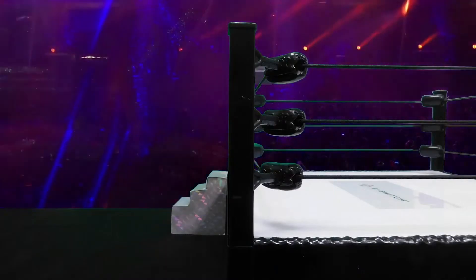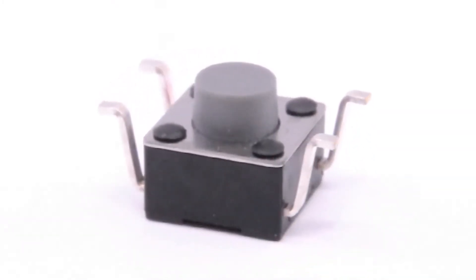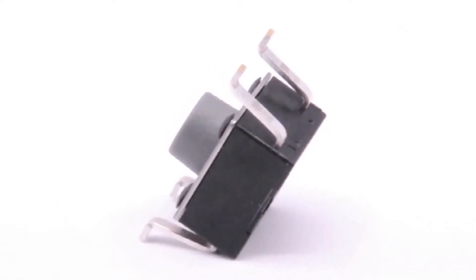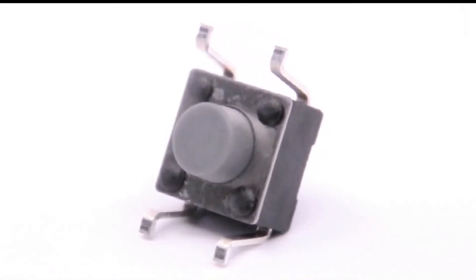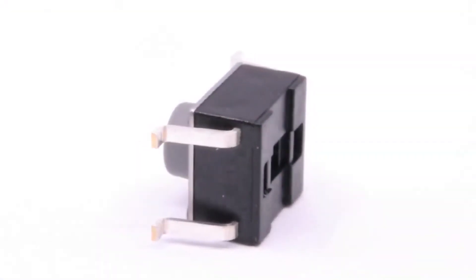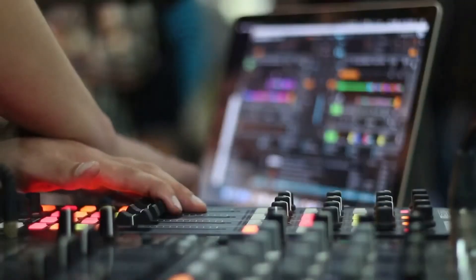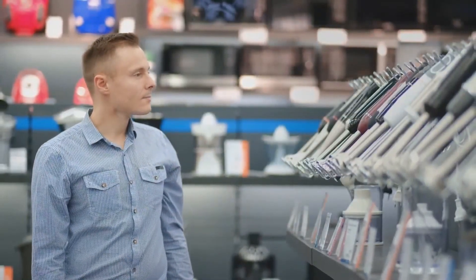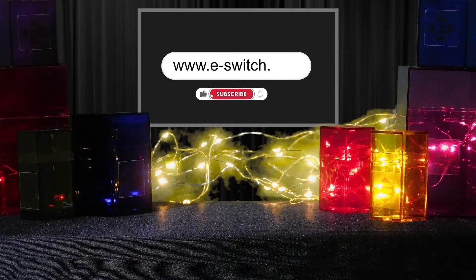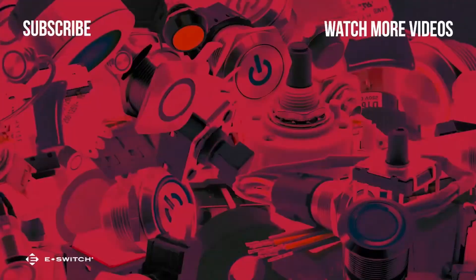The RT-3301 Series can fly up the top rope and needs just 260 grams of force to actuate. As a reverse surface mount switch, it can reverse any move you attempt. Don't let its small size fool you — it can last a long time in the ring. It can handle the heat with an operating temperature range of negative 40 to 85 degrees Celsius. The electricity in the arena won't phase it either, thanks to its 50mA 12VDC electrical rating. It comes as a tag team in tape and reel packaging with a thousand pieces per reel, ready for automated installation. It's an ideal match for audio-visual applications, computer peripherals, consumer electronics, instrumentation, telecommunication devices, and medical equipment. We recommend going to e-switch.com for the complete product page and our full catalog of switch products. Thank you for watching.